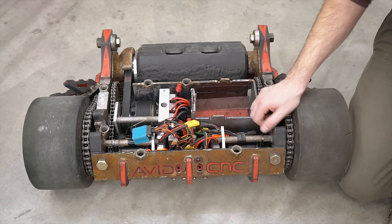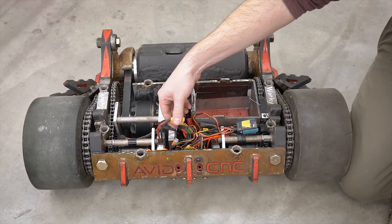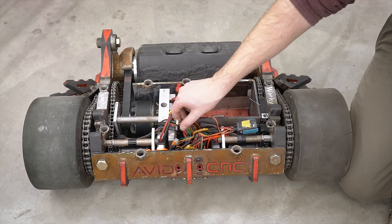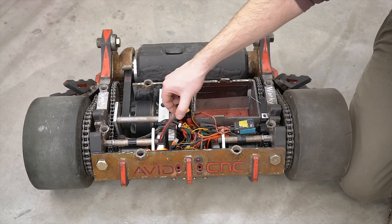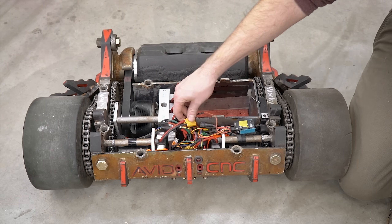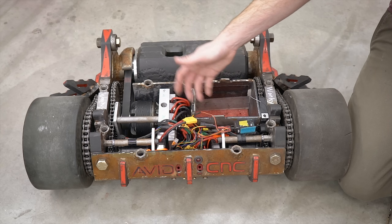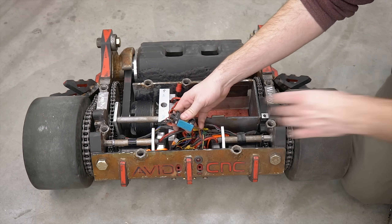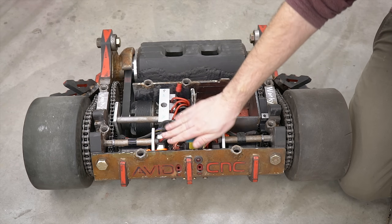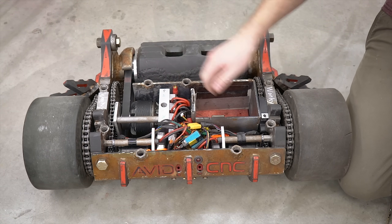The final things we need to do to get Copperhead ready for battle: reconnect this drive side to the connector, connect the sensor and all the other connections. Obviously every single connector gets fully taped with electrical tape before we go into the box — I'm not going to do that in this video because I don't like doing that when the bot's in storage — but every single little thing gets taped multiple times, zip tied, all the wires tucked inside, the top put on with loctite, and then it'll be ready for the arena.